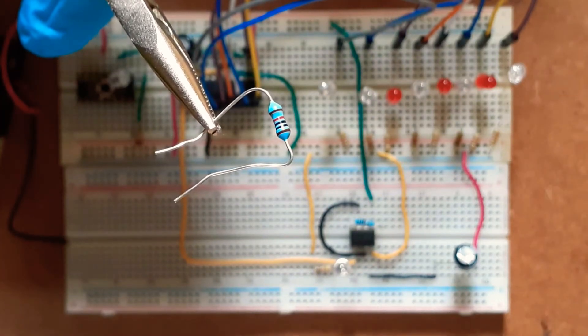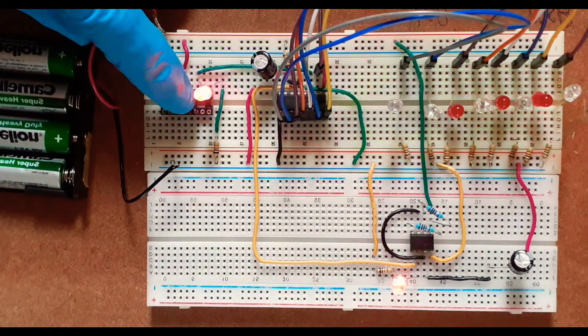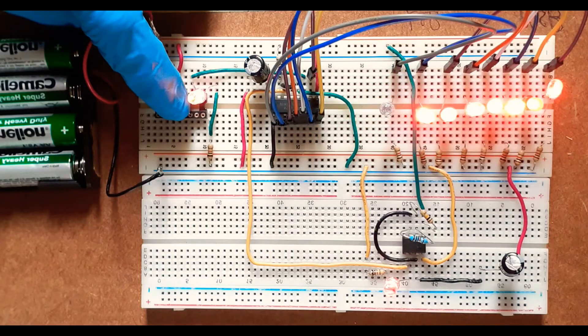You can see that data is moving a little bit slower. And if I replace that with a 100K ohm resistor, you can really see how the data is moving much more slowly than the other two times. You can actually change the speed at which your data is moving by changing the value of the resistors or capacitors connected to your 555 timer. That'll be it for this video — thanks for watching.